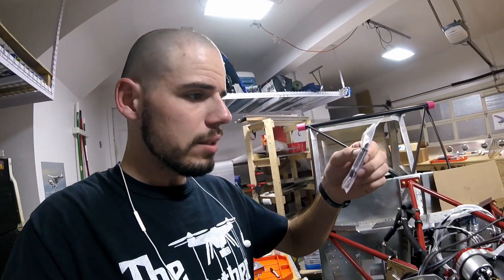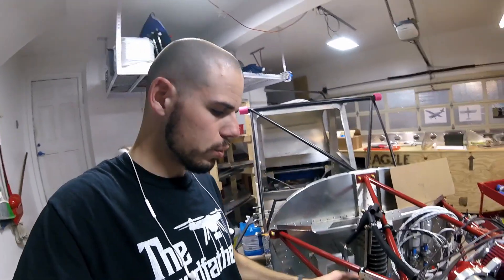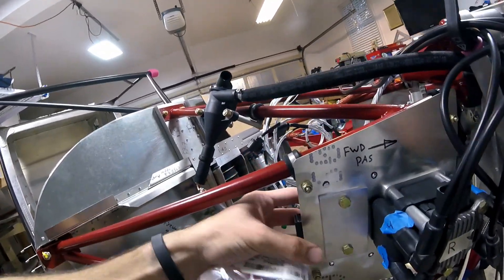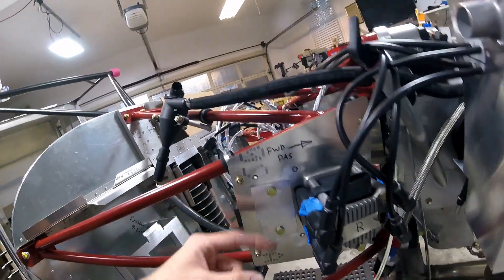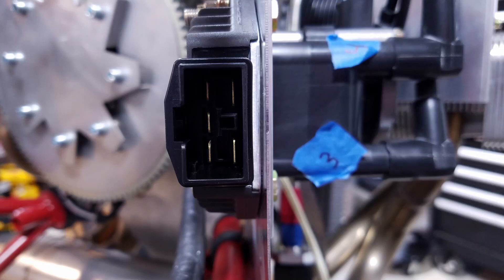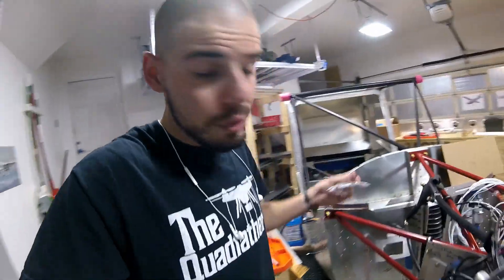This is pretty cool stuff. I think it'll work pretty well. This way it'll fill in that gap and create a really good thermal transfer layer — from the voltage regulator to this backing plate and then this thicker plate right here. Because that's the other good thing about this plate: it actually does act as an additional heat sink for the heat from the voltage regulator to go into. The voltage regulator gets pretty hot because that's just how it's designed.